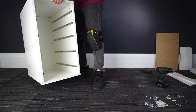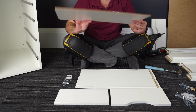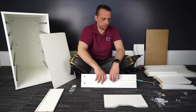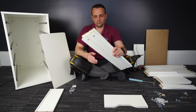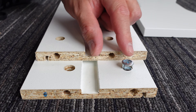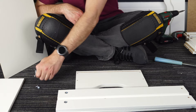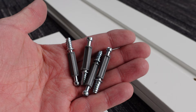Now I'm going to show you the drawer. You have one bigger and one smaller — I'm going to do the bigger one first. So what you're going to need: two side panels, one front panel, one back panel, one bottom panel, one side with grooves, one side plain, those screws, plastic plugs, and locks. Now the side panels — you have those gaps at the bottom and on the sides, and those holes. One is left, one is right. Place the locks — these are slightly smaller than the ones for the mainframe, but the same rule applies: arrow pointing to the front hole. Push the locks all the way in. Now the front panel — you're going to have four screws, same type as for the mainframe. Secure them in just till the stopper, not deeper, not higher.